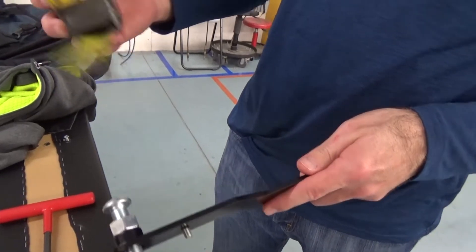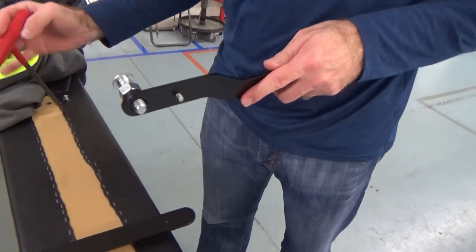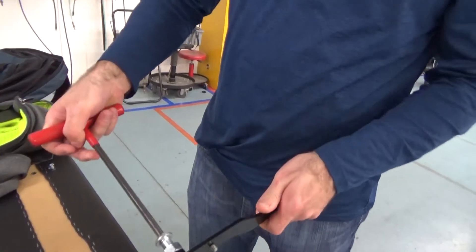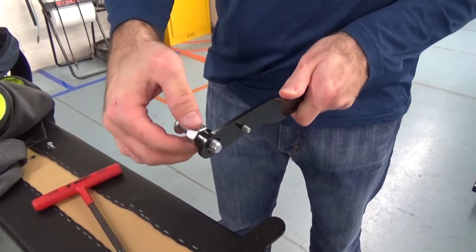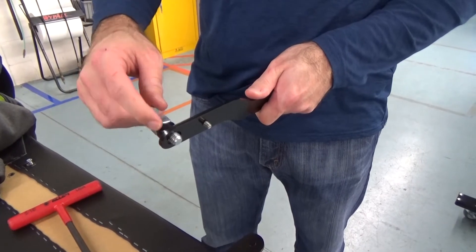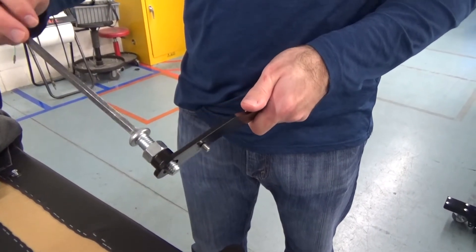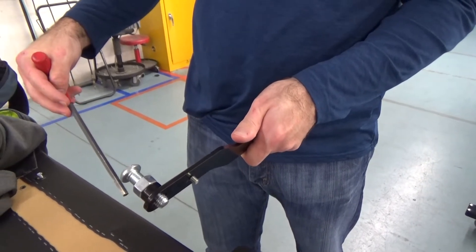To adjust the caster base tools, locate one caster base tool in the bottom channel of one caster base. Loosen the jam nut and turn the adjustment bolt clockwise to increase the display face angle, which tilts the face further back, or counterclockwise to decrease the display face angle, which tilts the display further forward. The face angle is adjustable from a minimum of zero degrees to angled back 15 degrees. Use a measuring device to set the adjustment bolt at the correct height to correspond with the typical face angles.